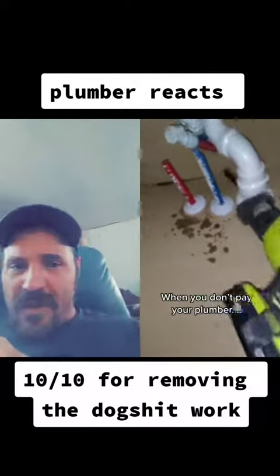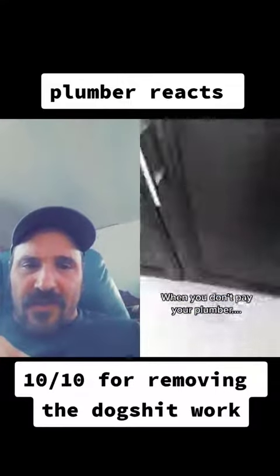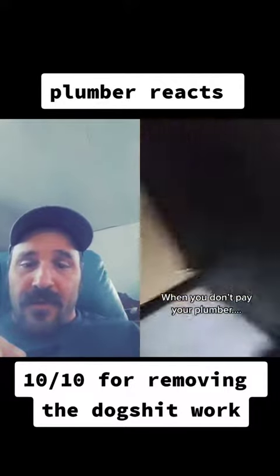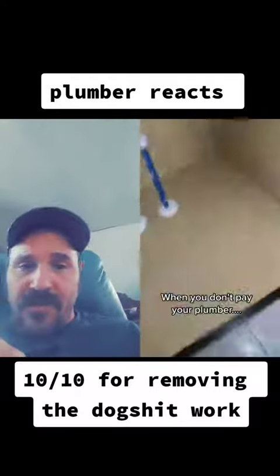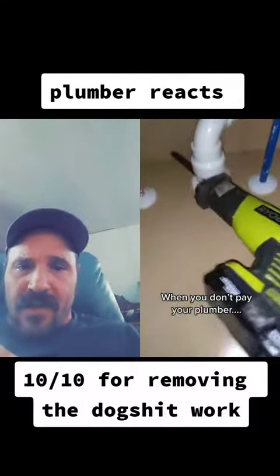They do work — I've installed thousands of them — but they have warranty issues and they fail a lot. One of the main reasons builders and plumbers use A-core stops is because they're really inexpensive, and A-core will actually guarantee them for a pretty significant period of time. So if they do leak, the plumber's insurance policy isn't the one that's going to pay for it, A-core's is. That's one of the big reasons people use those, aside from the really cheap price tag.